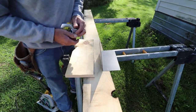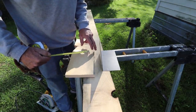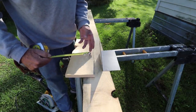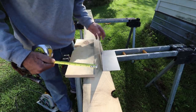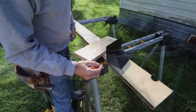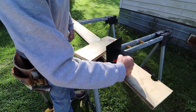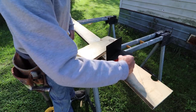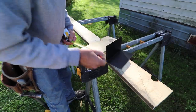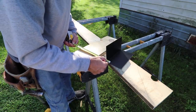And I think what I'm going to do is go down 2.5 inches, then I can put 2x material or a deck board, 1x material on top of here. You know, I'll have that option. So when I set this up, this is where that piece of metal is up there, and this is what I would want it set at. I have to drop down 3.5 inches.